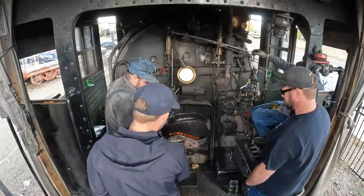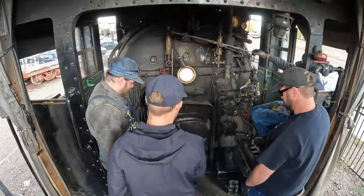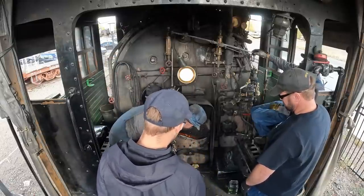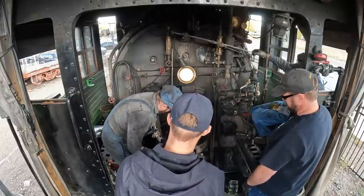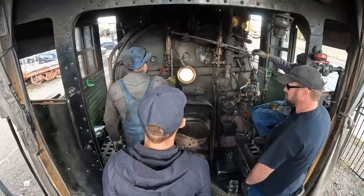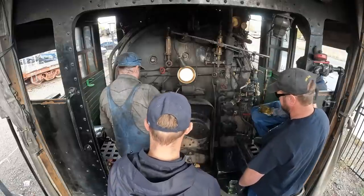Right now, because it's so low to the floor, I thought it needed to be up so you can kick it down, but it's not. It's just air pressure. I forgot it is pressure. Yeah, so there's an air cylinder that actuates right there, and the cylinder presses up, and that's what this guard is for. Sometimes it comes back, and sometimes it doesn't. Probably gets a little bit of coal dust and stuff in there. Yep. It's a little stiff.